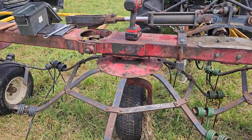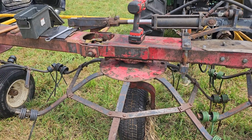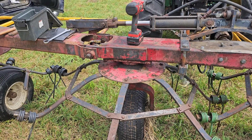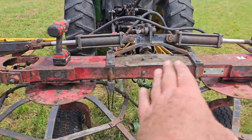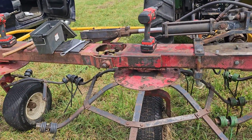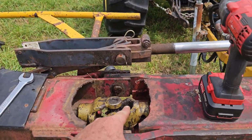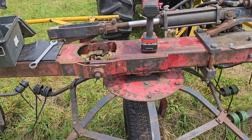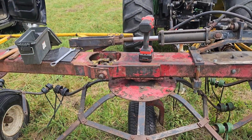So what I did was I took a piece of bar stock and turned it down so it was about a 3/1000 or 4/1000 interference fit with that hole, and drove it in. And then we reassembled this whole thing and realized that we were off by one spline, and in order to get it timed properly, it was a real problem to disassemble all that.